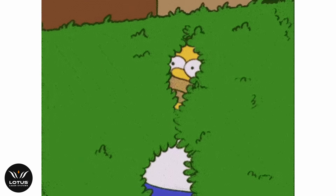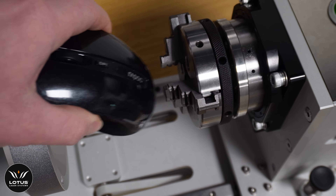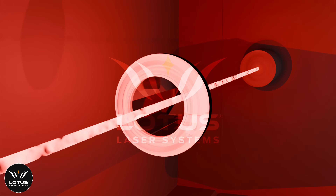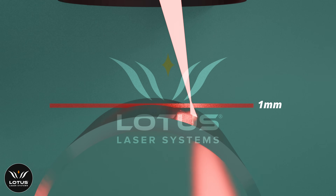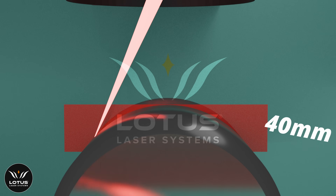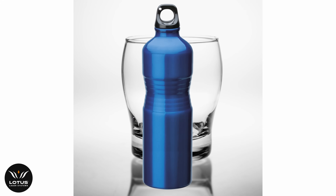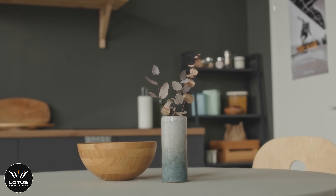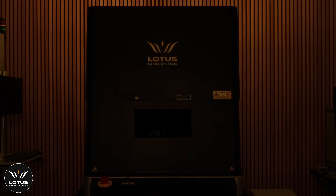Technically speaking, any laser can mark 3D if you're using a rotary, but it takes forever and for anything that isn't evenly round it's a complete bust. What you need is a focusing optic inside the scan head itself, which means you can adjust that focus point as you do the marking. A 2D laser will have a focus depth of about 1mm before it goes shonky, but with a dynamic optic a good 3D laser will be able to cover about 40mm, or 80% of the diameter of a curved shape. So if you're marking logos or names onto glasses, bottles, computer mice, headphone cases, or anything with a curved 3D surface and you want it done before the heat death of the universe, throw out the rotary and get a decent 3D laser.